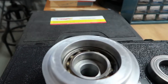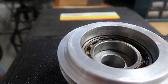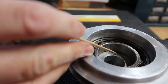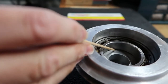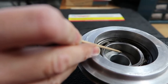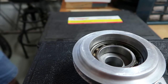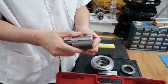See if I can give our viewers a better look in there. Sure. The bottom of that bearing, it's really difficult, guys. I'm trying to show you, but you can see it basically bottoms out. There's a little bit of curvature there, where the race of the bearing naturally has that rounded corner for putting bearings on and taking them off. See this clearance right here that I'm pointing to with the wooden stick? That's basically the chamfer on the internal race. That's what we're hoping to utilize, to catch on that by machining a little lip on the mandrel.